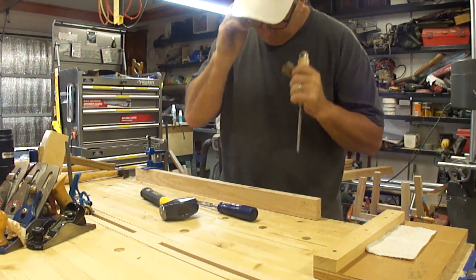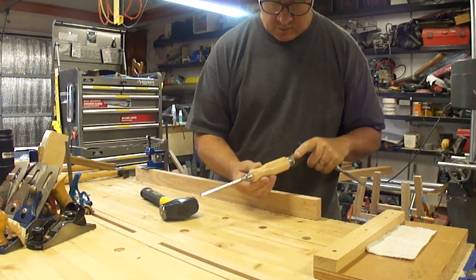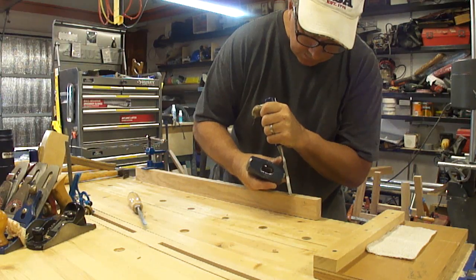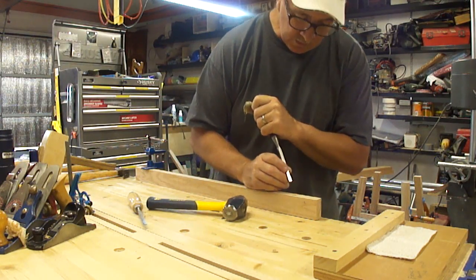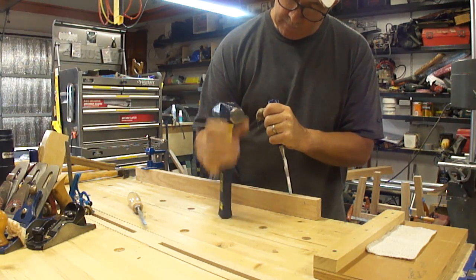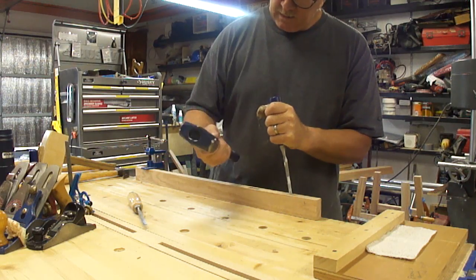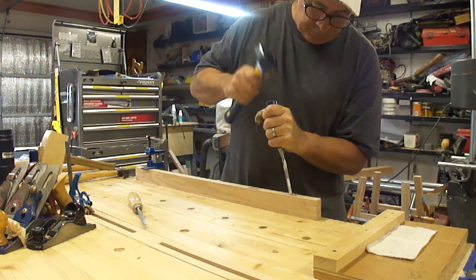When I'm chopping — I'll show you — I'm actually chopping. You could be using plastic chisels; I was using a wood handle chisel. Either one is prone to damage if handled wrong. I was using the tool by choking up like that — that's about as hard as you need to hit. The key is not to take too many bites this way, too much of a bite. You can easily get a quarter of an inch. At the most I'm choking down in here somewhere, or all the way up at the head. I'm obviously never down here, never just wailing away on it, and I don't want you to have problems with your tools and your projects.